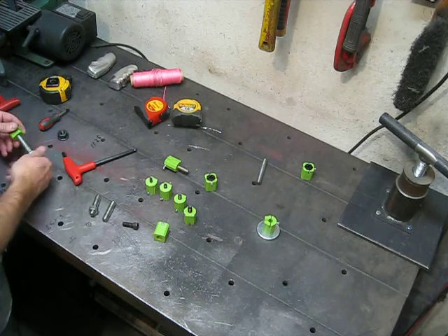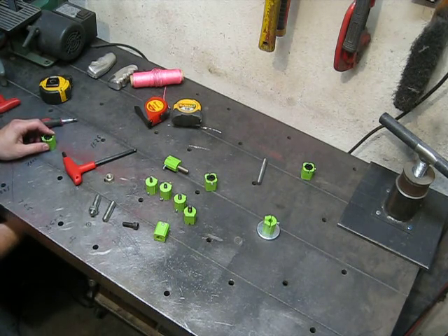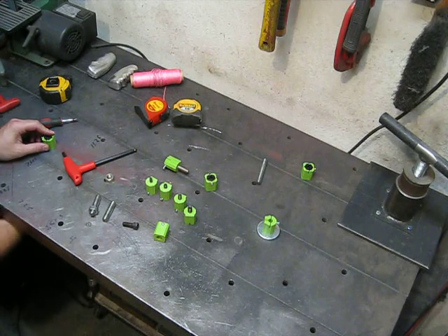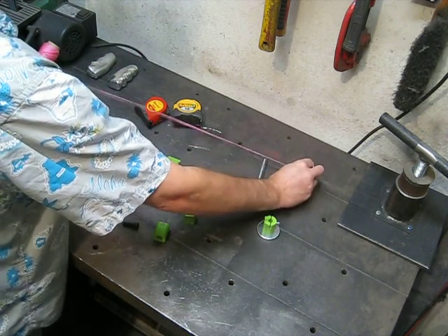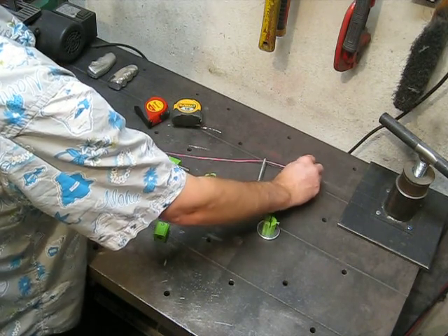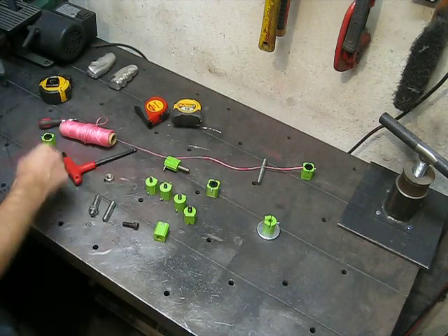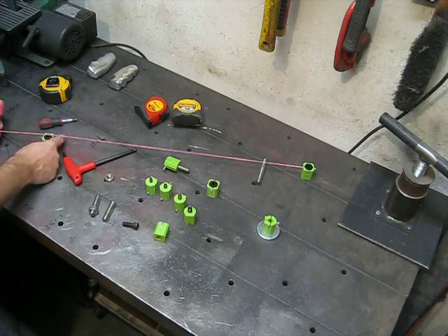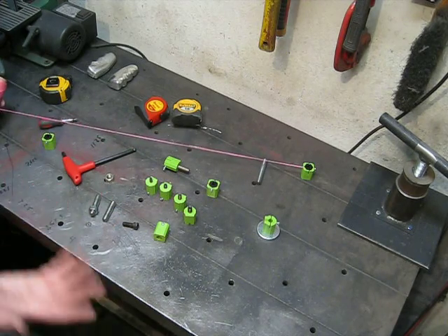This is really short on the table here so it doesn't really matter. You can use a normal nut or one of these ones from my milling machine. Another feature is that a lot of times I'm running strings through things - I want to see where items are going to go. I made these little notches in here so I can just put a string right in there. When the string goes through here, it's exactly an inch off the bottom. I can pull these strings, run them through, turn them sideways, run them down, and do crosses or other configurations.